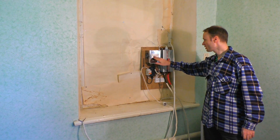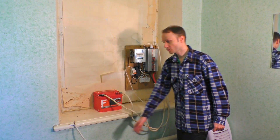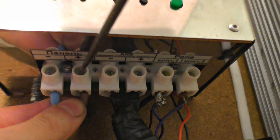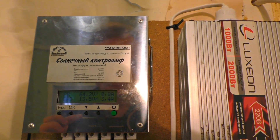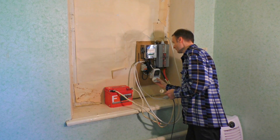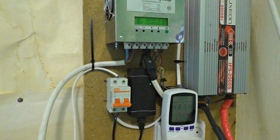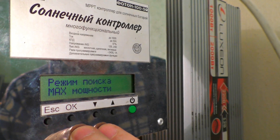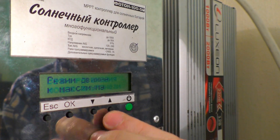Let's attach the sun controller. For a start we're going to use a simple car accumulator, then I will get some lithium batteries. The next step is to connect the solar panels to the controller board. Oh, a spark — plus and minus. Initialization — okay, there's a launching process, and we can see the battery started charging. Let's turn on the inverter. Let's try to use the accumulated power. The sun panel controller must be set in a specific mode via settings — it has special watt-ampere characteristics that let it squeeze out everything the solar panel can give in any weather: clear, rain, or cloudy.